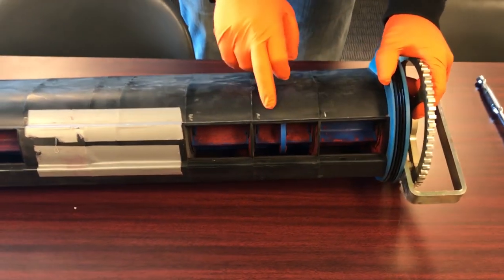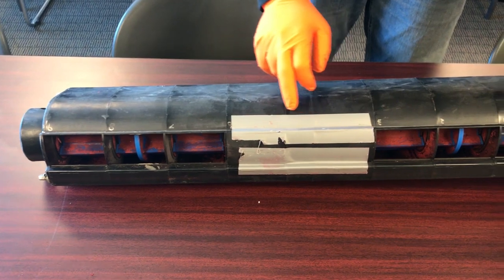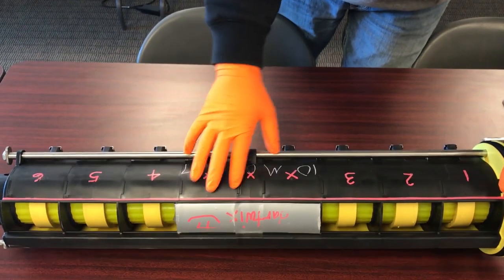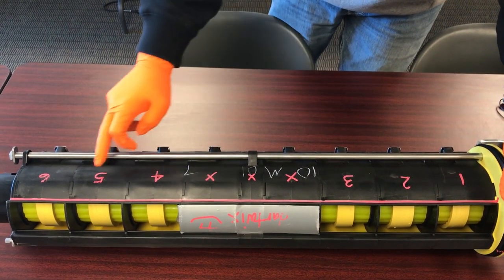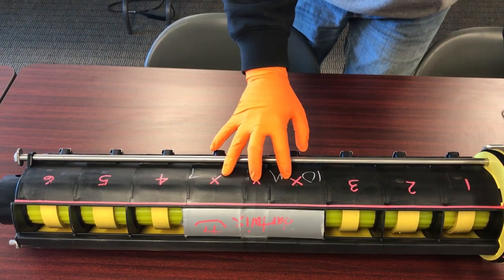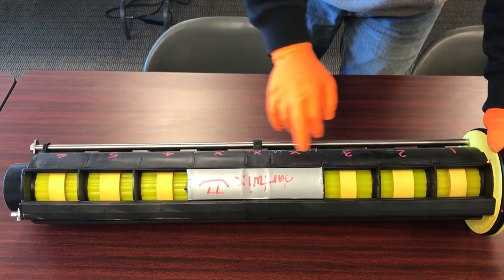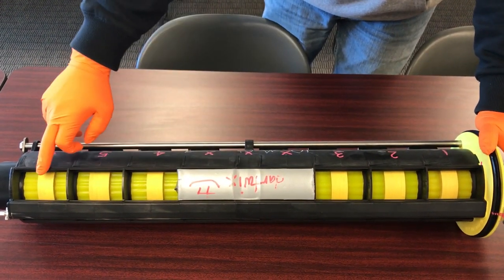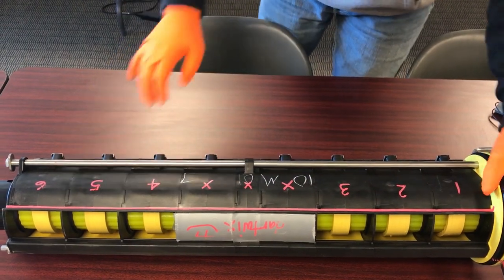You can see that they're numbered 1, 2, 3, 4, 5, 6, 7, 8 — but depending on the number of runs you're using, this will be 1 through 6. On the newer ones we do paint marks — we'll mark a line across all the individual enclosures 1, 2, 3, 4, 5, 6, and 6 primary. The centers are not getting used; they're plugged and we'll put a piece of duct tape over them. They need to stay in order because if you're reconfiguring or tearing apart an existing roller, the tuning rings need to match up to the primary, as that corresponds with the number of secondaries on each primary. Good practice to just label them to keep them in order.